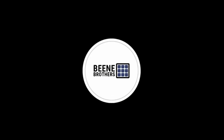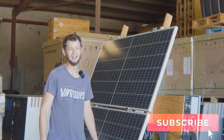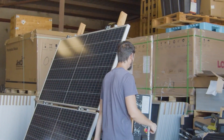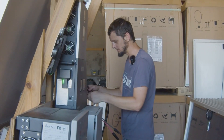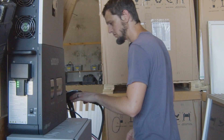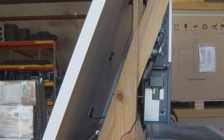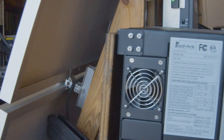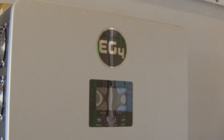It's dropping because the panels are getting hot. So it's time to get rid of these 400 watt panels. We've got 570 watt bifacials and those are so much better. I got these two panels in series with each other, running to just a little 60 amp charge controller. This is my charge for big batteries so that when my Leaf runs out of charge, I can actually get home still.